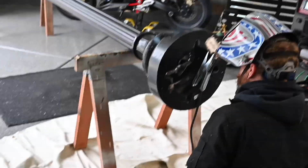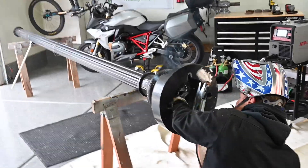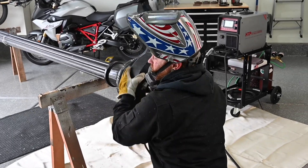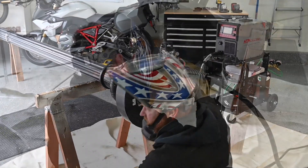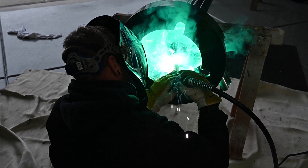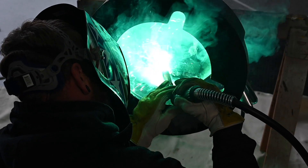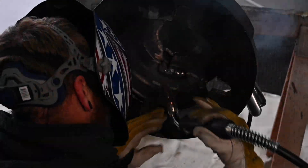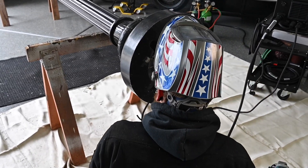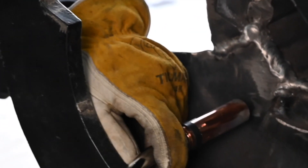It's not bad. This stuff's like running a glue gun — it just goes right where you want it. It's not winding at all. I'm going to grind this out a little bit. Wow, I really like this wire. It'll fill that big hole in, no problem. That joint is welded in very nicely. We're getting good, real strong penetration here. I'm very happy with it.